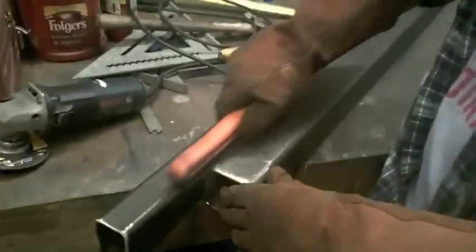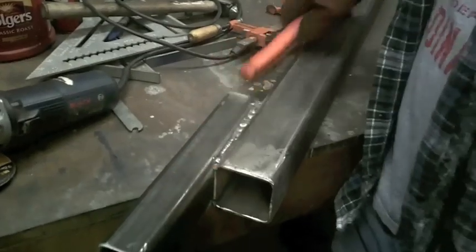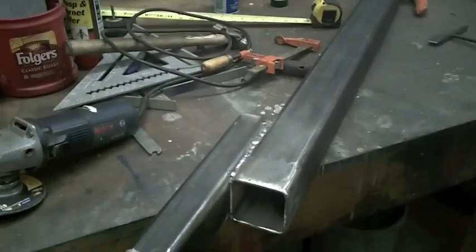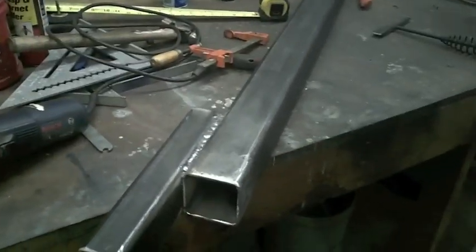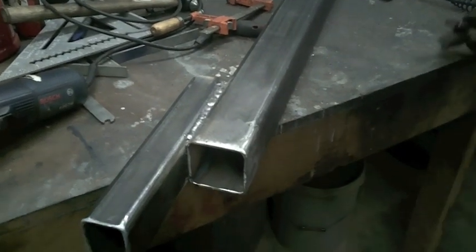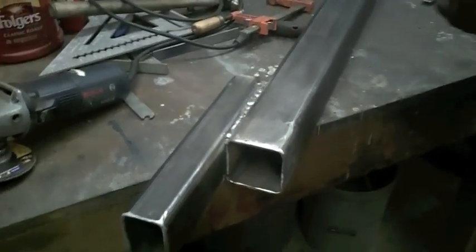It's really important to keep all welds clean and all the metal to be cleaned. After each weld, you have to brush it off and start back on with fresh metal. There's a slag or residue left after the welding process, so every time you stop and start again, you have to re-clean the surface.